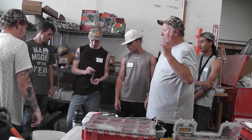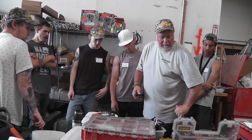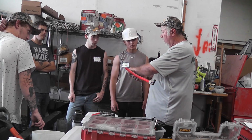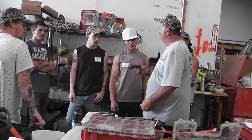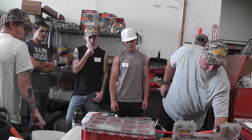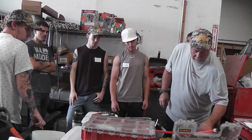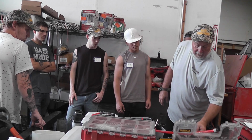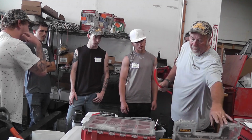A 3/4 inch line is your main feed. Put that in there. What you do then is you can run 3 lines off of this to put in fixtures. That's what they call a manifold. So you're turning 1 line into 3 lines, and you're not putting in couplings. If you've got 90s, as you can see, you can pull it off. And if you're going to change the size of your pipe, you go from 3/4 to 1/2 inch. So that's what this piping system does.